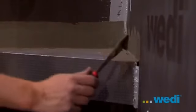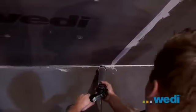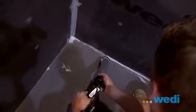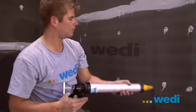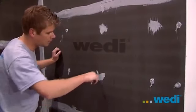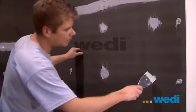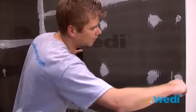You'll also want to apply more sealant to all inside corners of the complete shower system and trowel flat. This will act as a surface flashing in addition to the depth of seal between all parts. Use all excess sealant to cover all fasteners or apply with your sealant gun. Make sure all fasteners are completely covered, including the complete washer tab, so no metal is exposed.